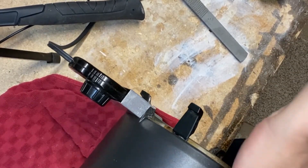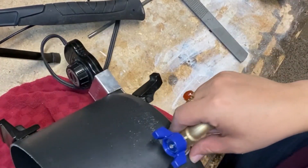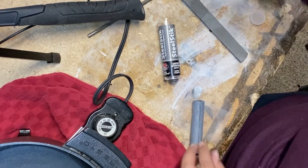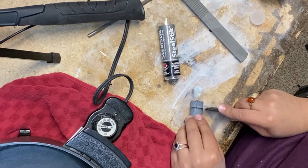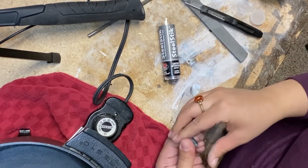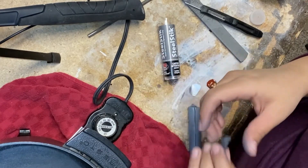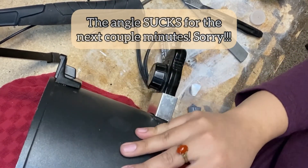It's looking really good — just need to twist it a couple more times. There we go — yep, that looks good to me. All right, now let's get the JB Weld mixed. It has two parts to it, so what you're going to do is take off a little bit here — probably about that much — and then start mixing it together until it becomes one solid color.